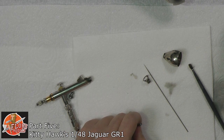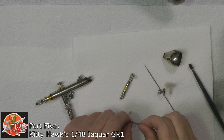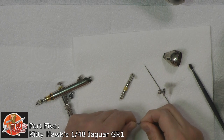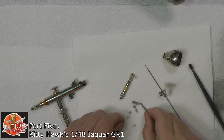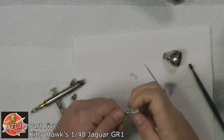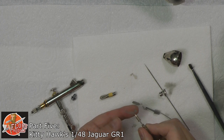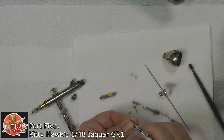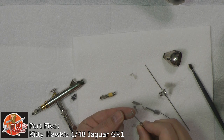Then hopefully you'll have a cleaning brush set, and a reamer. Now normally you can buy these specifically for your own model, but they're quite handy. So this one here, I'm just going to go in with the brush first, a couple of twists and pull out. And as you can see, it's very thick paint down there. And then the reamer is literally just a blade looking item. Slip this in, and immediately at the front end, you can see paint appearing. So the chances are what this is, and there we go, you can see a large lump of thick paint.